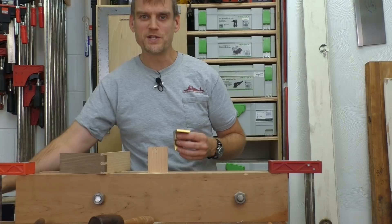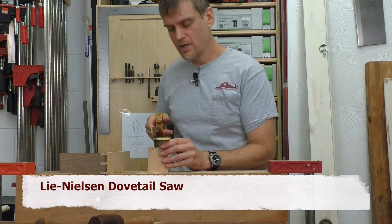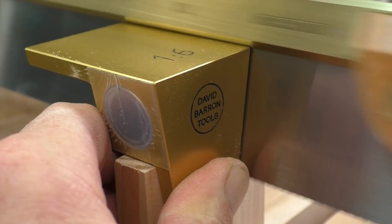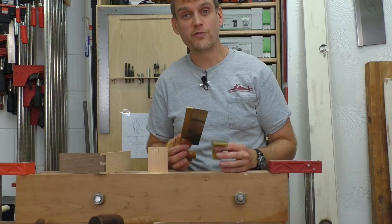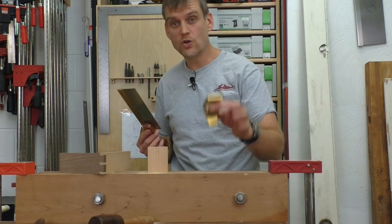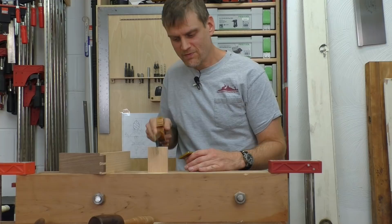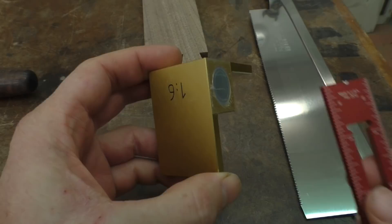Does this work with western saws? Absolutely. This is one of my favorite dovetail saws, a Lie-Nielsen saw — I can hold the guide up, bring it right up, it catches, and go ahead and cut dovetails. With this small western dovetail saw I get three-quarters of an inch or so — pretty good for any type of dovetail, but if you are doing big case work maybe you want bigger dovetails. You could start the cut with the guide, get a three-quarter-inch kerf established, then take the guide away and continue that saw all the way to the back for a really deep cut. The kerf guides the saw beautifully. To be specific, this guide takes away one and one-eighth inches from your depth of cut, so check your favorite saw to make sure it is going to work for you.